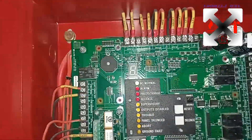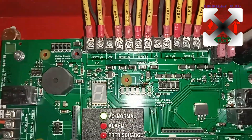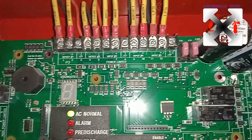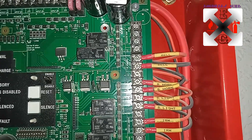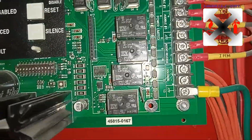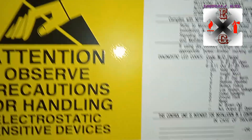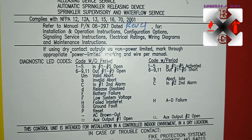When I reconnect the battery, it will automatically clear — and voilà, it's gone. The same logic applies to other codes. If there is a trouble on Zone 1, you get code '1' with no dots. Zone 2 gives you '2'. The MRS gives you '3', the abort gives you '4', and the LPS gives you '5'. For output troubles: '6' is for the bell, '7' is for the horn strobe, '8' is for the strobe light, and '9' is for the IRM. If you have a solenoid connected, you get '11' — because the display skips '10', going from 6–9 and then 11.